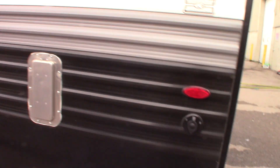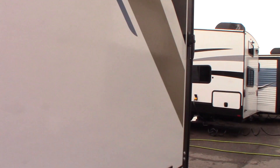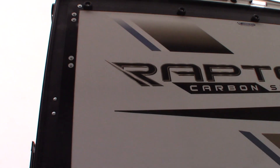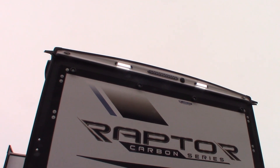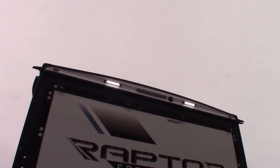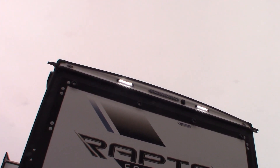The other garage vent — this is just cable and satellite through. You can see up there that there's actually a housing for a backup camera, if you wanted to add one. While we're looking up, remember to inspect your roof on a regular basis. The manufacturer says every 60 to 90 days go up there and look around — make sure everything's in good shape, no cracks or separation, no damage caused by low branches or road debris. Make sure roof inspection is part of your regular maintenance.